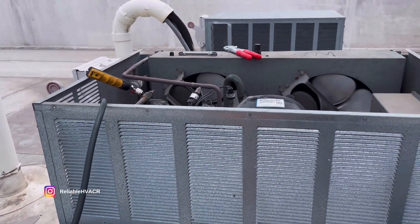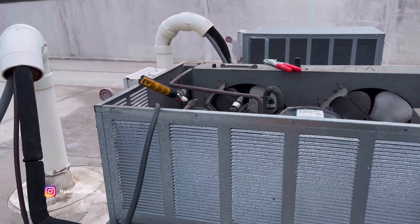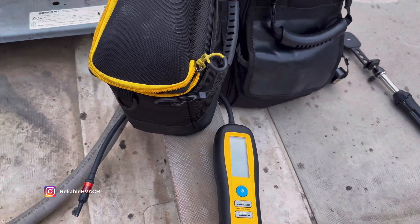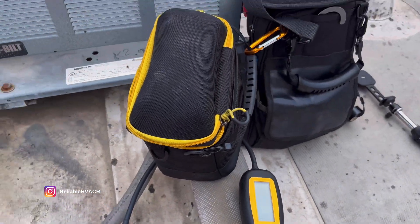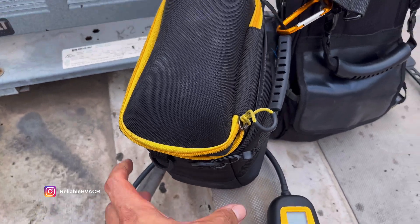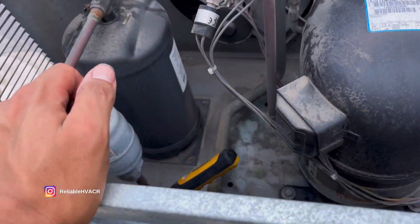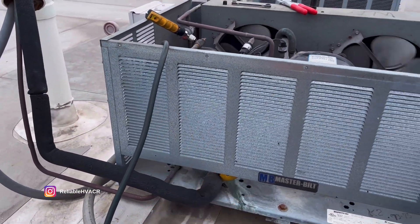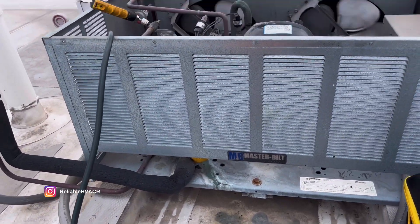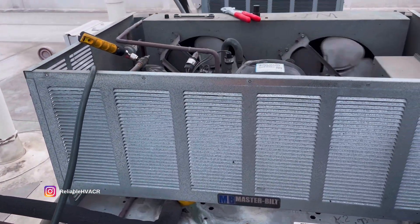We probably just don't have enough charge to pass the TXV, so we've got to pinpoint it with our DR82, which did a great job. I checked the other side just in case — nothing there. Now we're going to check pressure and superheat with our FieldPiece probes, just top it off, and then I'll talk to the customer and see what they want to do.